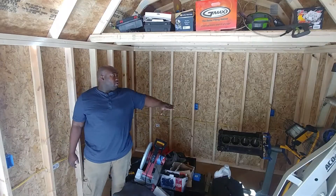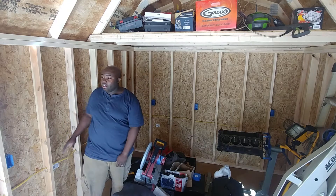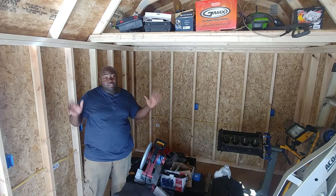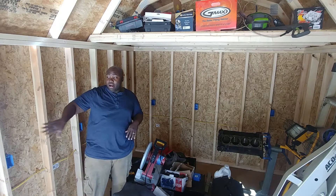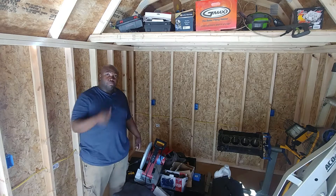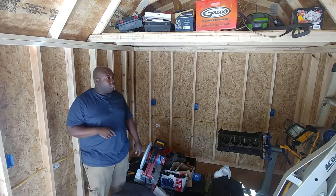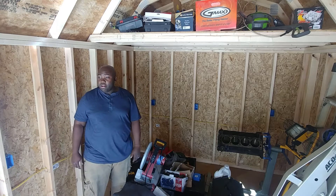I've got the electrical wire ran around the side. Some people feel like it's weird the way I do it, some people say it's fine — I guess it's all personal preference, even though I'm not an electrician. When I go to wire each outlet box, all I have to do is give a little bit of slack, then I can just pull it on up, make my connections, go to the next one, cut it, pull it on up, and just keep going like that without having to stop and fish through each section.